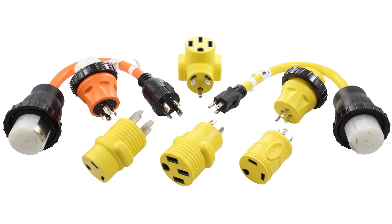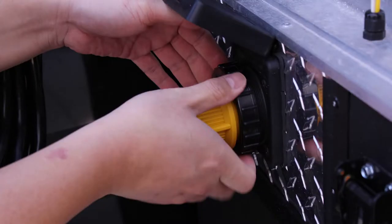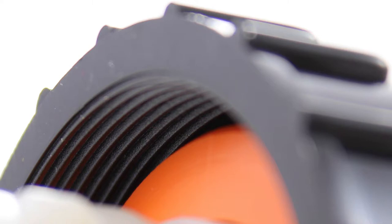There are just a few things to keep in mind when selecting them. Your shore power inlet should be weather tight. The same goes for whichever connector you will be using to connect to the power pedestal. It's best to select a power cord or adapter that comes with a locking ring on it. This locking ring will help prevent water or other debris from disrupting and ruining your connection on your boat.